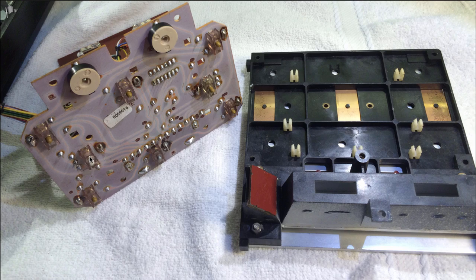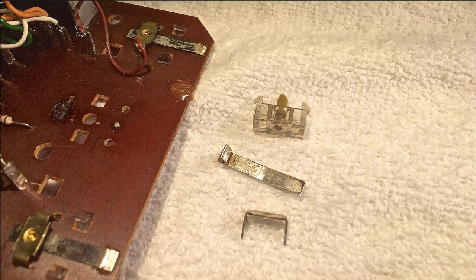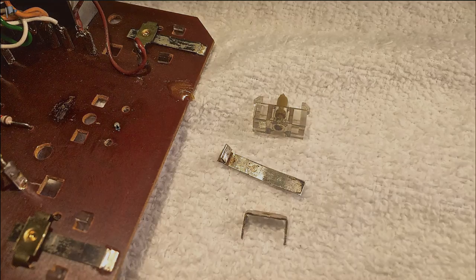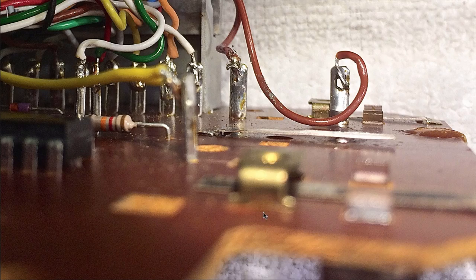Here you see the board after I lifted it out, showing the two contacts for the slide transport. To get the contact terminals out, you need to remove the plastic part by pressing the plastic clamps together, then unsolder the terminals and push them through to the other side. You can see it's slightly corroded, but the main issue was the bent terminal. After straightening it out and cleaning with a fiberglass pen to remove all oxide, the terminals are nice and shiny and now press properly on the contact stud.